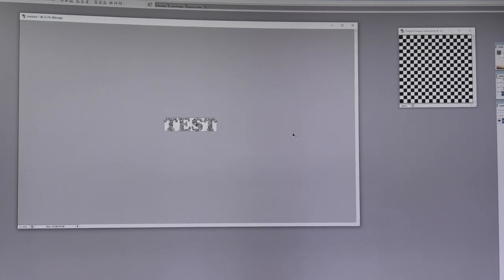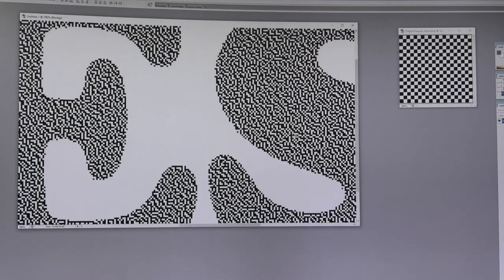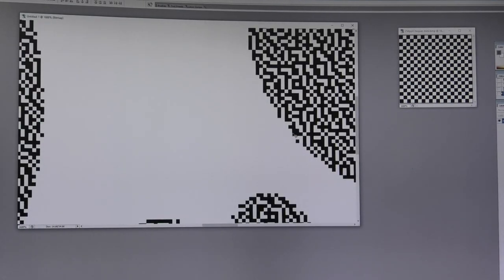If I zoom in, what you'll find is we've got 0.1 pixels like this. We've now got 50% black and 50% white. Okay, so it's not quite a checker pattern, but the principle is exactly the same. 50% white, 50% black. Your eye mixes and sends to your brain as mid-grey. But of course, mid-grey is not something that the laser can produce. All it can do is change these pixels into little pulses, dots. And that's what we've been trying to achieve.